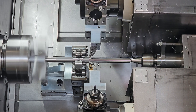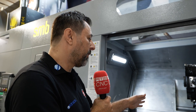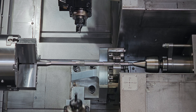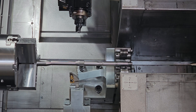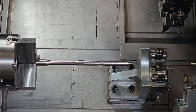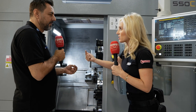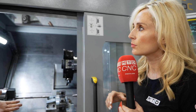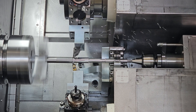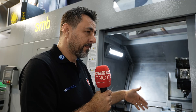Using the gantry, you're turning that part so it comes off complete in one. We also have a programmable steady rest and programmable tailstock, which provides efficiency — for example, the programmable tailstock moves faster, driven by a ball screw, so we gain seconds. The programmable steady rest is important for decreasing vibration of the parts. So you're talking precision, accuracy, and time savings. If we support the parts with the steady rest, you can cut at greater depth for long parts, which decreases cycle time.